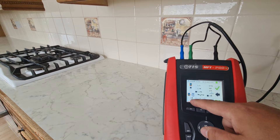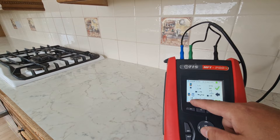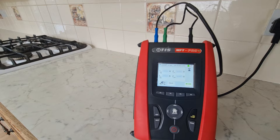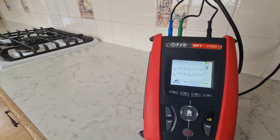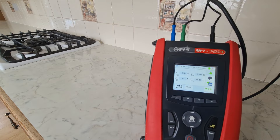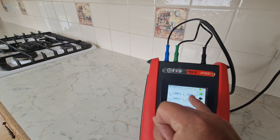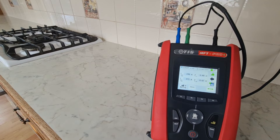Just for interest, if we stick this on no-trip mode, we shouldn't get any real difference because there's no RCD in circuit, but the instrument does work in a different way when it carries out this test. And roughly speaking it's about the same. So on LPE we've got a similar sort of value for fault current and also similar circuit impedance. Note on the line-neutral loop, it's actually a little bit lower - and again this isn't a true TNC-S system at the head but external of the install I would expect at some point it is.